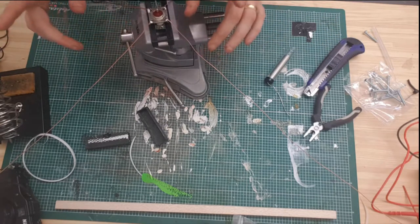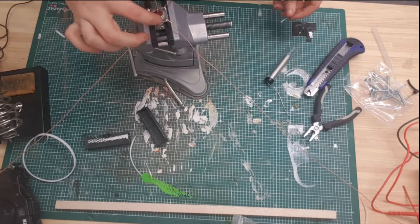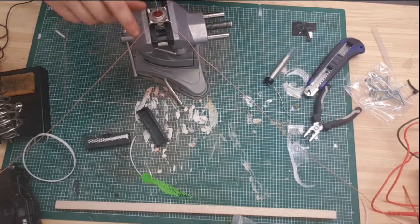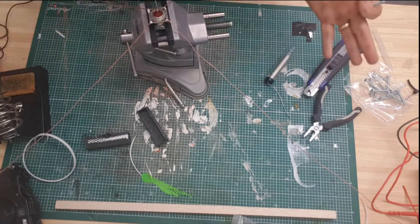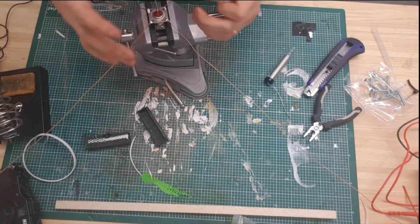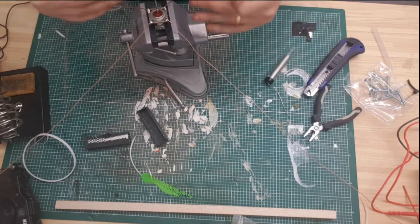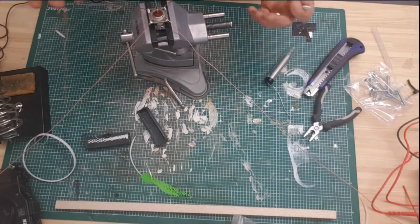to make an antenna. Now, if you want to avoid soldering altogether, and if you solder like I do, I would recommend it. What you could do, especially with these kinds of connectors, is get a bolt, run it through, and have a nut and a washer on the other end. You can hook the copper through it and just screw the washer down. And you're good to go. Something like that is handy for portable antennas. If you wanted to take something like this out into the field with you, that would be a way to do it, because then you could collapse it down and have it in a more compact carry case, rather than having it all splayed like this.